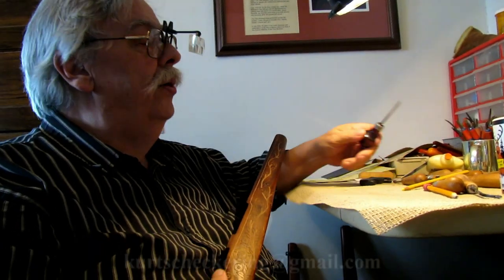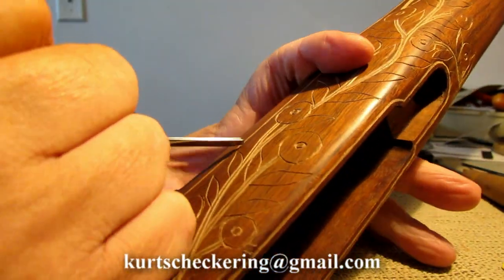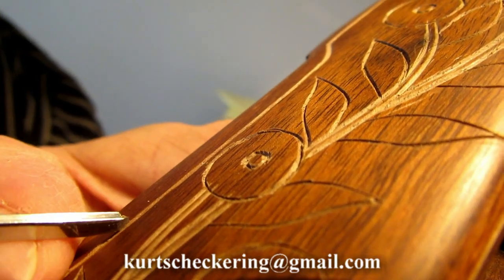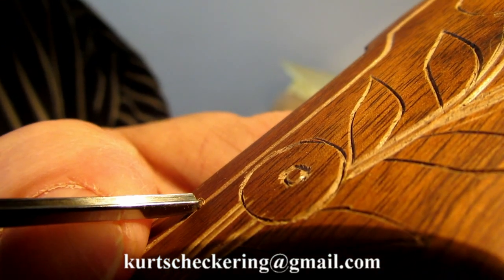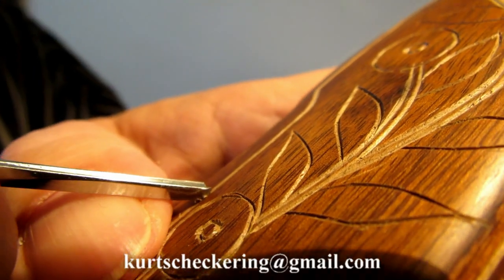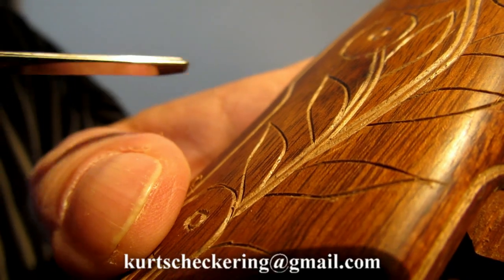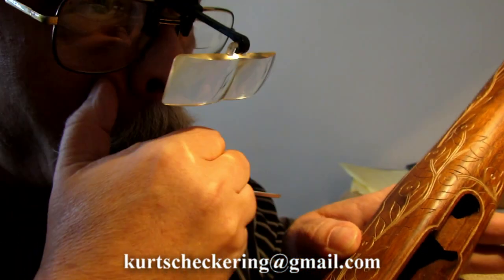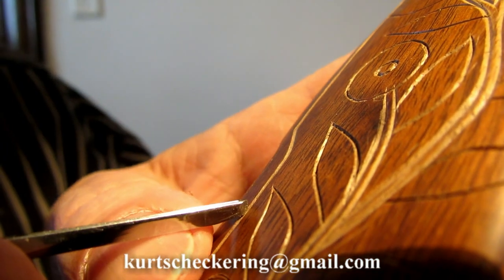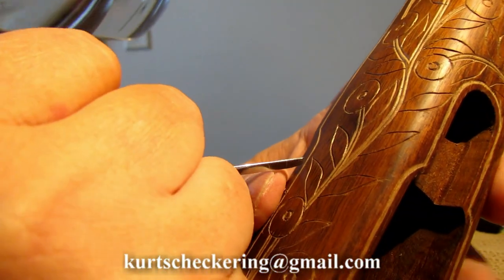That being accomplished, it's time to go to your veining chisel — a very fine V-chisel made very sharp. You get into that line and cut it out. It's all a secret of control. You've got to push enough to get it to cut, but be ready to hold back — one foot on the brake, you might say, like driving with one foot on the brake and one on the gas. With my right hand I'm holding the chisel back with a fully flexed arm, and the forward motion is done with my left hand thumb pushing it forward. I only ease up the tension on the right hand enough to allow it to go forward at a controlled distance and rate.